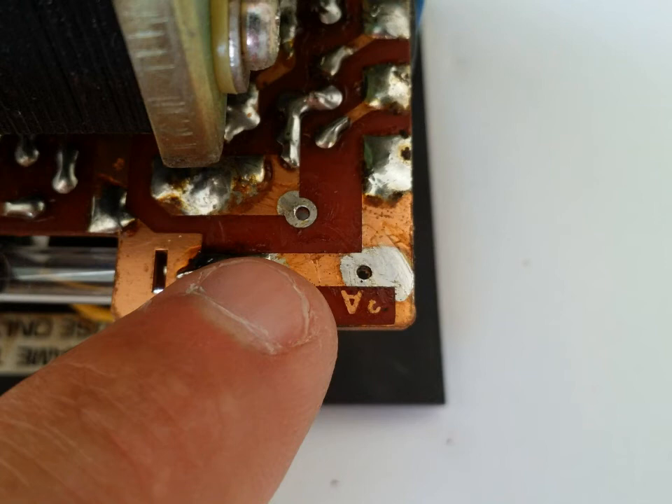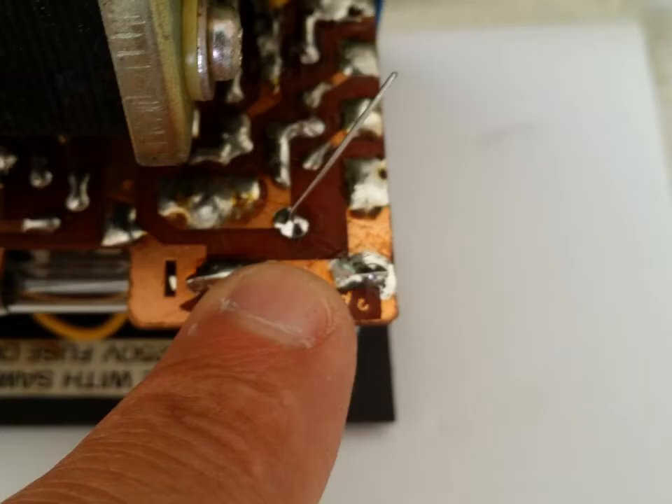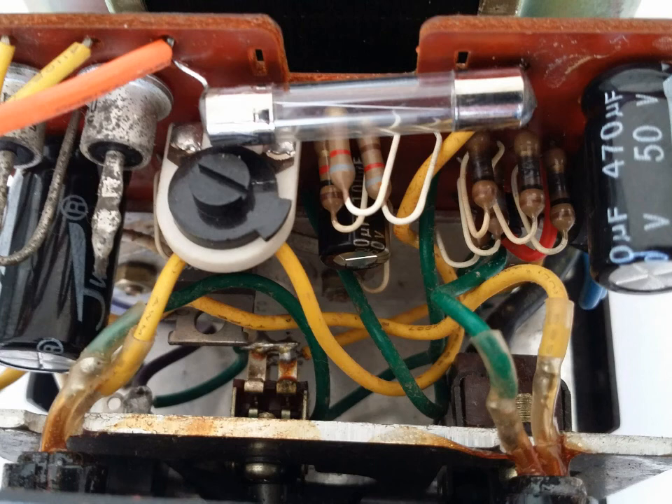There's a fuse in the front and a fuse in the back. The fuse in the back had a really rinky-dink holder that wasn't safe. I installed a special fuse holder — one I can solder on both ends and screw through the base of the unit — so the fuse is easy to access when it pops. I drilled a little hole and replaced it with a nice mounting holder. The fuse in the front is a pigtail fuse that's real easy to change; you just buy a replacement pigtail fuse. Both are now user-friendly for this customer.